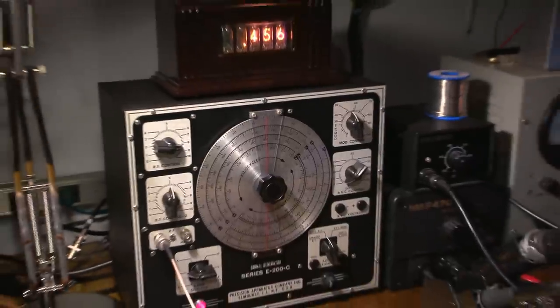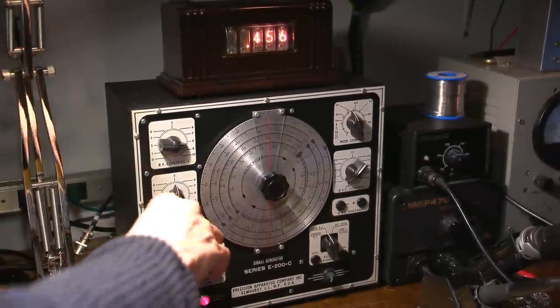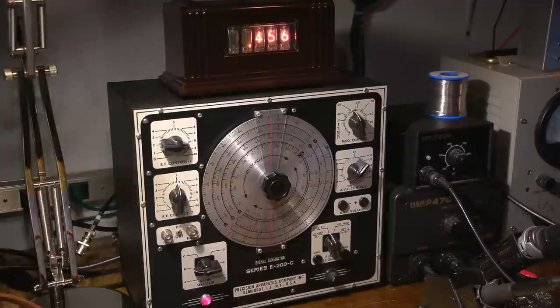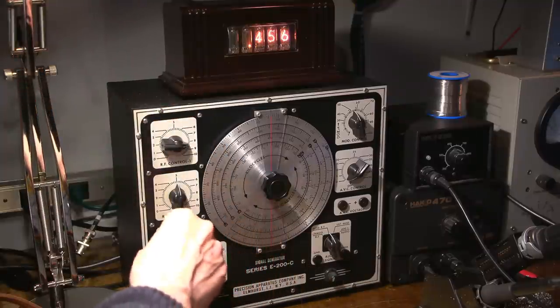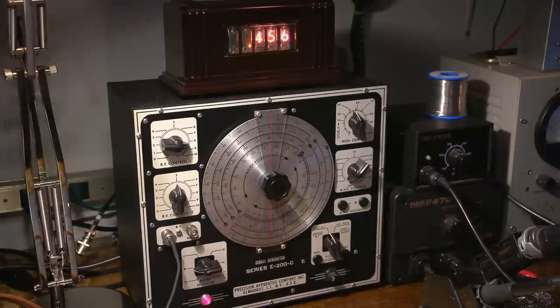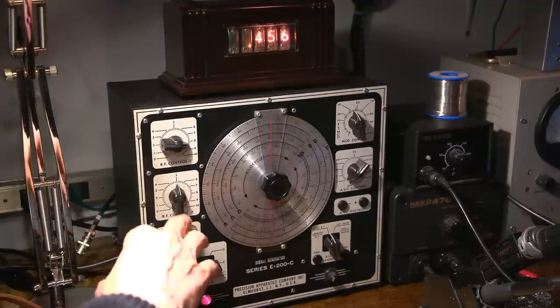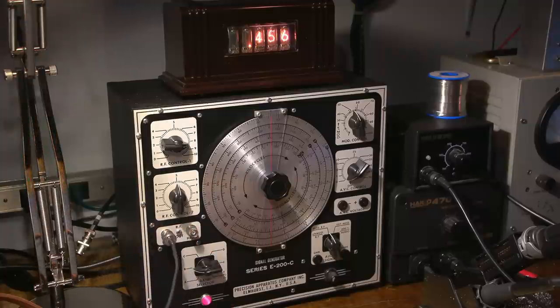the signal generator. Get rid of this. And I'll hook up my test lead. I'll just get a piece of coax out of here because it's in the way. Put this on here like so. I can leave the amplitude. This is at the low RF out. It has a low and a high RF out, so the amplitude at this output is much lower.